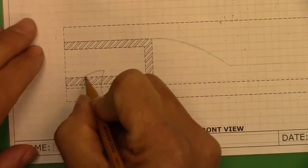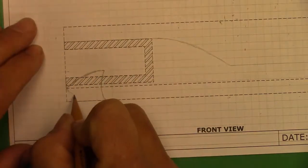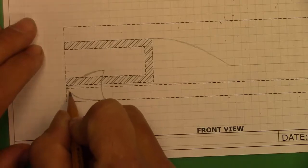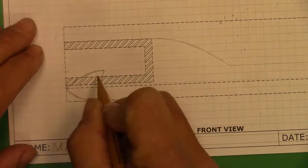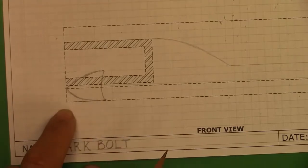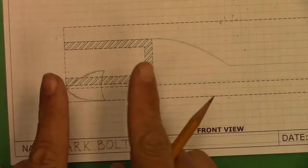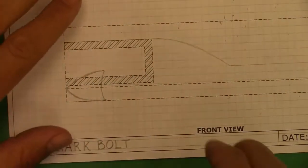Maybe I'm going to draw something like this, and I'm just sketching. And I'm going to draw something like this. And this airfoil here has enough material. Yes, it does have sharp points, but they're not thin sharp points. So remember, I could even in time remove a little bit more material after I cut this out to reduce a little bit of mass. But as long as I'm keeping that minimum length and minimum height, that's what's important.